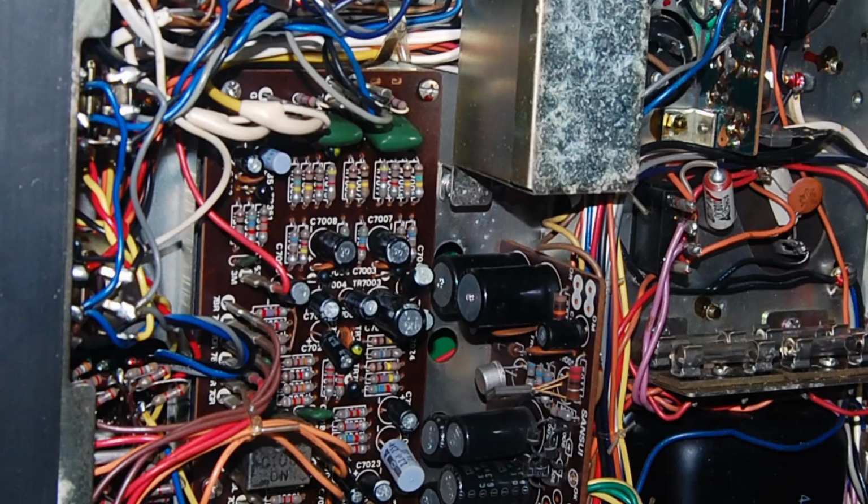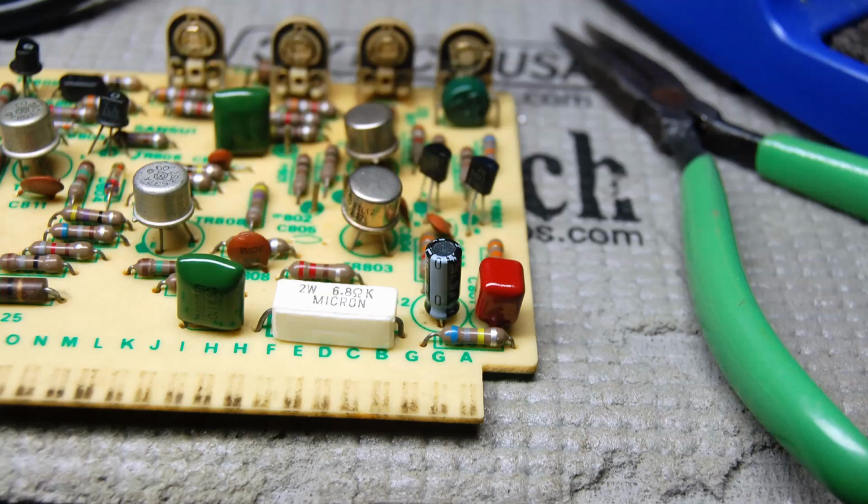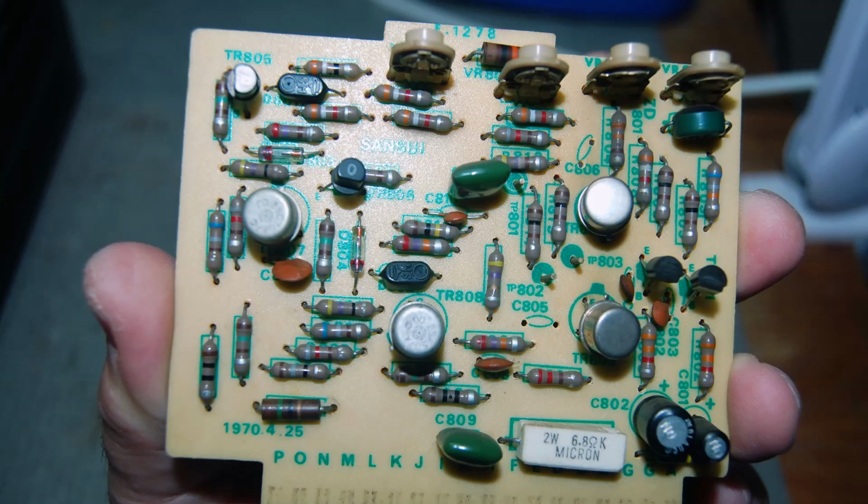So I troubleshot that problem first. I'm going to get in there and I'll pound the table here. I'm going to get those electrolytic capacitors, but I wanted to fix this first. And it was caused by 2 transistors on the driver assembly. So I went ahead and actually, let me tell you about the driver assembly. They just unplug from each channel. So they're quite easy to get out, quite easy to get in.